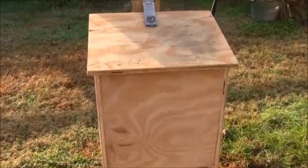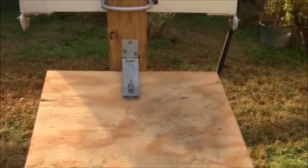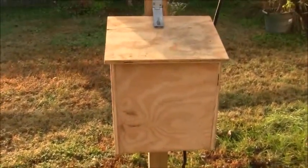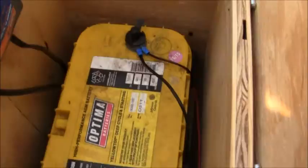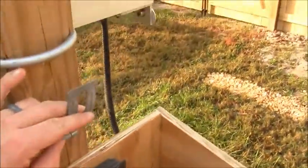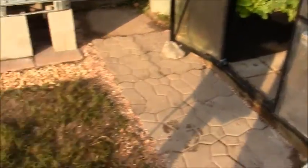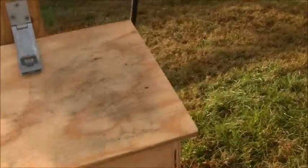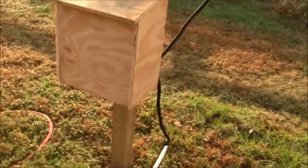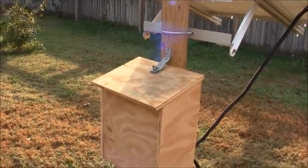I translocated all of the solar system components. I now have a solar generator out here. I got the battery and the charge controller out here in the box — I just built this yesterday. So it's really simple: just the battery and charge controller. And since the wire is shorter, I'm not having to bring the charge all the way into the greenhouse. It'll be a bit more efficient because DC power is not efficient over long wire runs. So that 100-watt solar panel will be able to charge a little bit better.